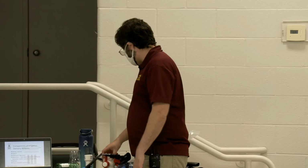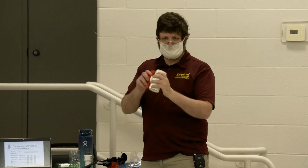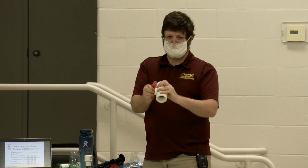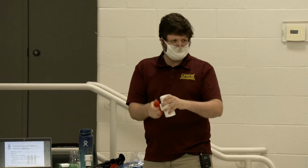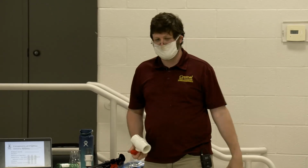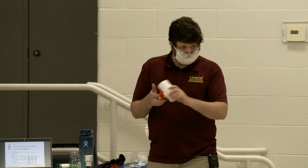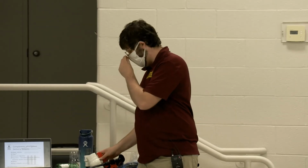Other things that you have will be you might have ball valves throughout your system of various sizes. That allows you to isolate different sections. Obviously, so you can just open and close if you want to only irrigate part of the field. If one part of your field just gets wet more often, rather than setting up different zones on a fancy system, you can just use valves. Totally doable, totally easy.